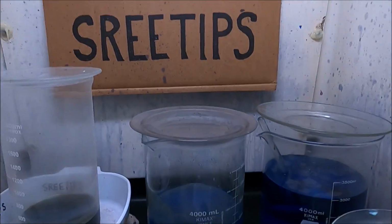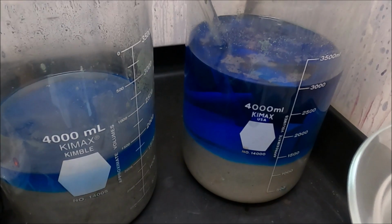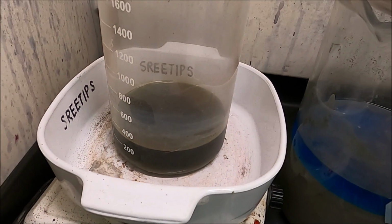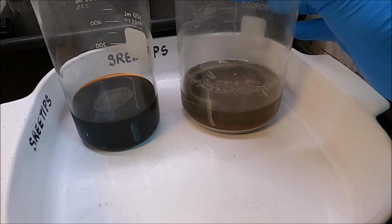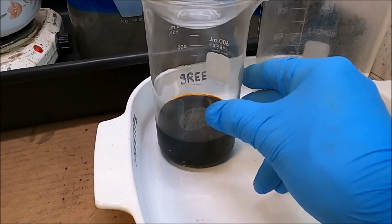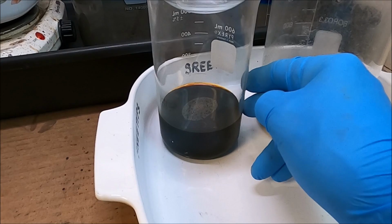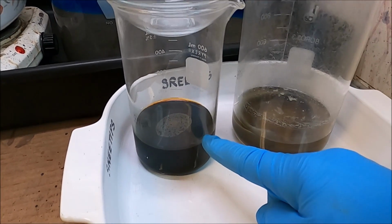Down here in my fume hood, I've got all this silver back here that I need to get cleaned up, rinsed off, melted up into shot so that I can run it through my electrolytic silver cell. This is the jeweler's palladium and silver solution, holding one of my tall 2,000-milliliter beakers hostage. I got to get that done. Down here, this is my experiment with trying to refine some gold-filled scrap with sulfuric acid. Working on that. This is some remnants from my stock pot refining series. There's probably 3 or 4 grams of palladium here mixed with copper, and I'm practicing on this, how to separate the copper from the palladium so that I can refine this. That's holding a 600 milliliter beaker hostage.